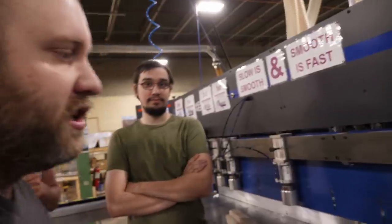25,000. That was it. So when we're trying to figure out why the hole depths are so inconsistent, well, it changes along the length. It changes on what parts you have clamped in, how many zones you have clamped in. It's like a stupidly complex problem, which is why it took so long to drill down and figure it out. It flexes, but not to the naked eye. You can't notice, so the operator loads it, and then that was the inconsistency.